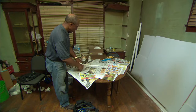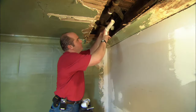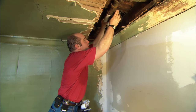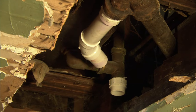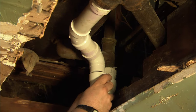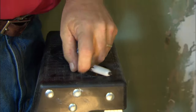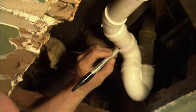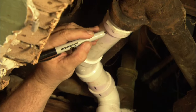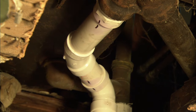Now it's time to clean it and glue it. Here are your fittings that are already glued, Cliff. I'm going to dry fit it one more time before we glue it to be sure the angles are correct — there's a 90-degree elbow, and be sure it fits our trap. To help us glue at the right angle, we can make a couple of witness marks: one on the fitting, one on the pipe. Then we glue them up and make sure the lines line up.